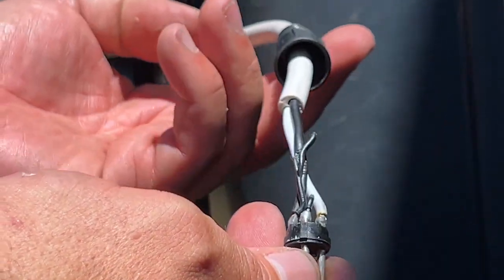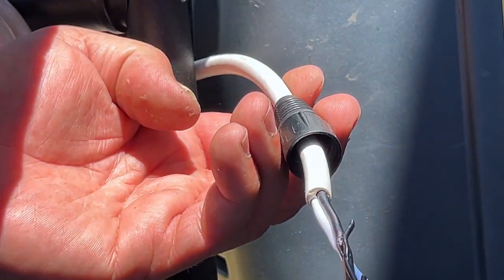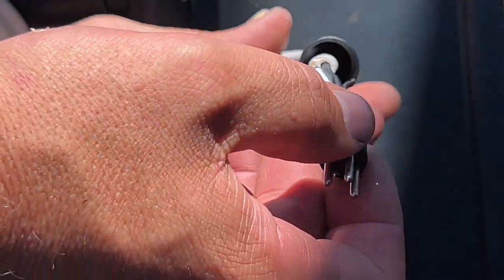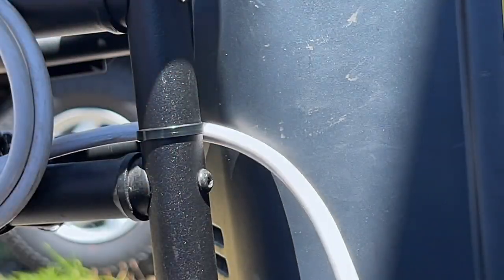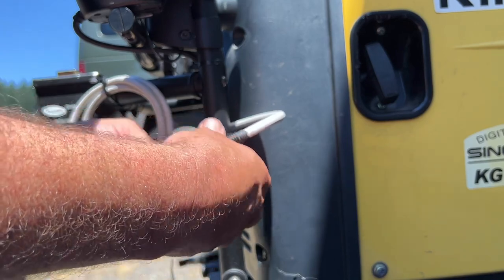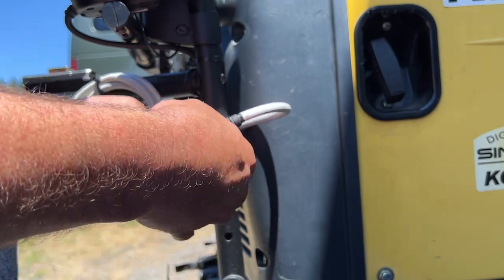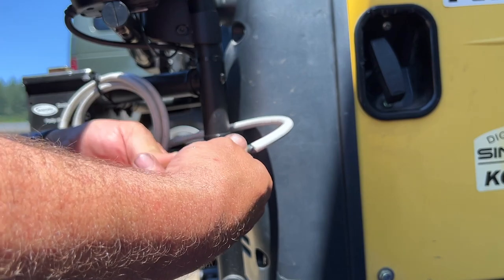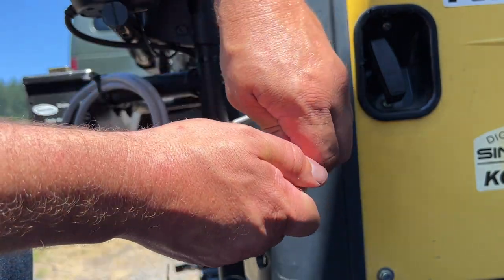I don't recommend doing this on most chairs if you're actually running around, because you can easily overrun the charger and your wiring, but this is a generator and yeah, stuff. I need to grab some electrical tape though and extend the sheathing just a little bit here. Let's make sure our wire is not turning as you thread this on. Otherwise those wires will twist up and short out. And the second you plug it into the chair, it's basically connected across the battery and the whole thing will go poof and the magic smoke will go everywhere.